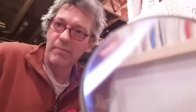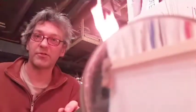All right, so the marble's in the annealer. That's a bigger one. I'll leave that in there for about 2 hours and then I'll start ramping it down. And so now I want to purge my torch and my lines. What I'm going to do there is turn off the oxygen first. So I'm going to turn off the high side, the high pressure valve, and as that oxygen escapes the line, woo-hoo! I'm going to turn off the low side. So now all the oxygen's out of the line and the valve set is completely off. I can turn off the needle valve of the oxygen on my torch.